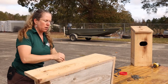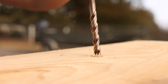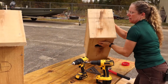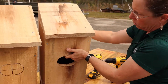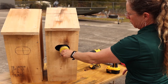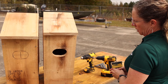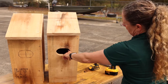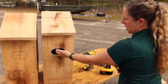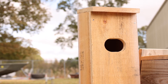Finally, you want to put in a hole for your threaded rod that's going to hang the wood duck box onto the post. I'll show you on a box that's already done what your hole looks like. You make this hole with a hole saw two different times to get it, and then you can use a rasp to make the inside smoother for the ducklings and the hen to come in and out. They've done research on what size this needs to be — to keep predators out but yet let the hen go in and out of the box. So here's our completed wood duck box, all ready to go out in the field.